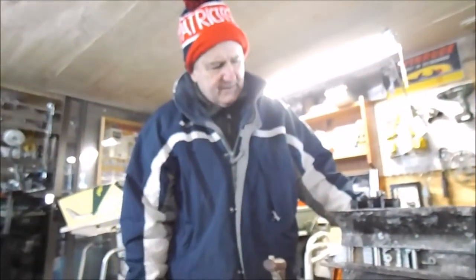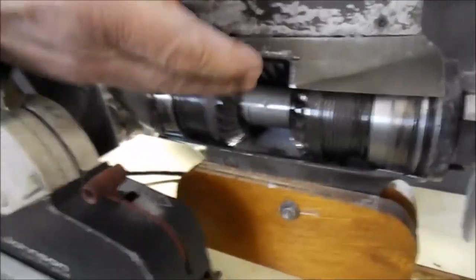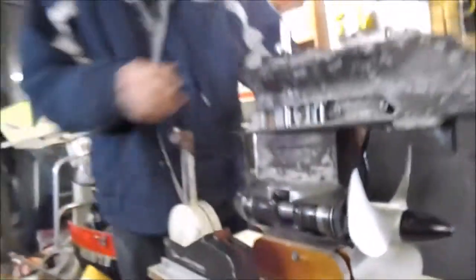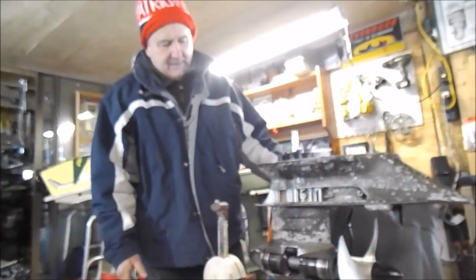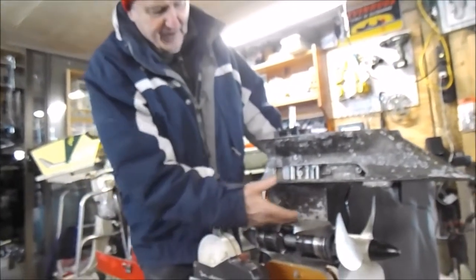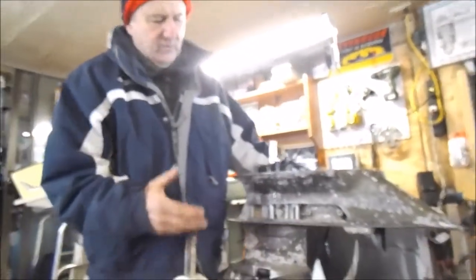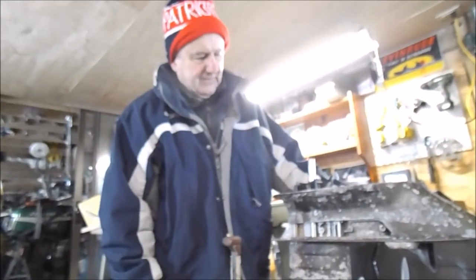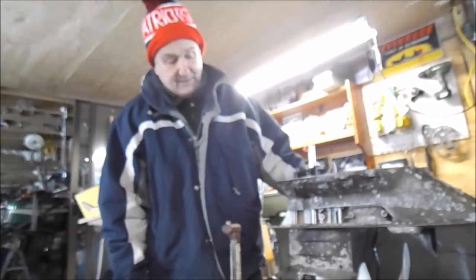This lower unit was in place for a few years but had a couple of flaws. One was that if you lost electric current to it, it went into neutral — that's where it stayed, so you couldn't go anywhere if you lost battery power. Secondly, it found its ground through the casing and not through the wires, so it didn't have a wire ground; it had a base ground in the lower unit, which corrosion could affect. The wires going down to the lower unit could also corrode.